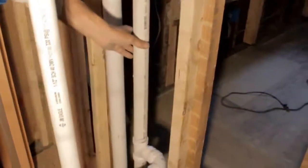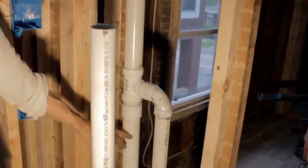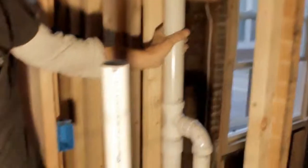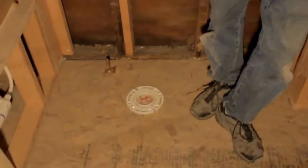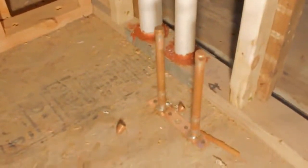This right here is our drain for our bathroom sink. All right. This is also a vent line. That's why this Santee's in upside down. So it's like this. The reason this is 2" is because this is venting the toilet right there. You have to have a 2" vent for the toilet, or at least a 2" vent. So this is nothing but a vent line.